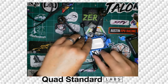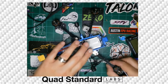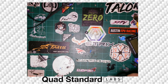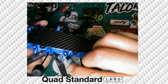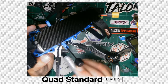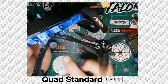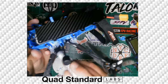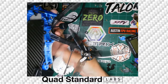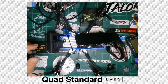Dry fit everything first and make sure all wires are where they need to go. Once it's screwed into place, apply a little additional sealant around the edge and in between the wires — really squeeze it into that edge where the extra holes are. Put a nice thick bead across there, smooth it with your finger or the edge of a credit card, and go all the way around the entire bottom piece.